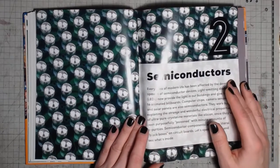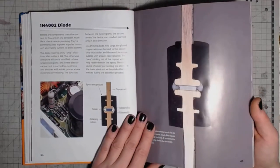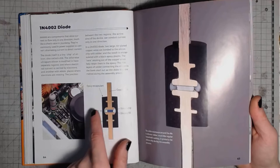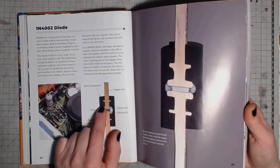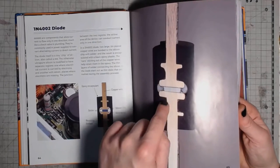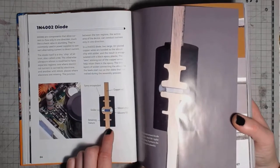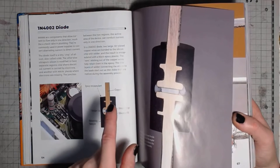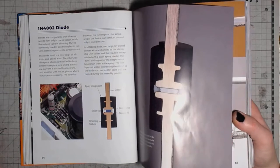And let's move on to the active components, the semiconductors, all kinds of semiconductors. A regular rectifier diode. It's just a slice of silicon. One part is doped positive, the other one is doped negative, placed between the metal leads using solder as the layer between the metal to make the contact surface better to get into the pores.